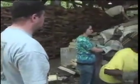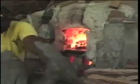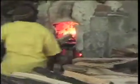Day one. This is 24 hours, and we're right at 1600 degrees Fahrenheit. We've moved through kind of the danger zone of the pots cracking or the pots bloating, and from here forward, from 1600 up to as the cones bend, it's just a balance now of fuel and fire. Have there been any problems or anything unusual? No problems to date. It's gone really smoothly so far. It's been very nice.